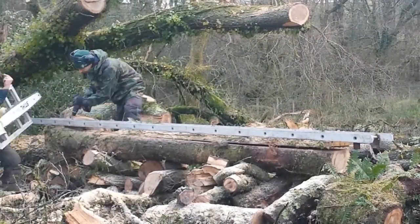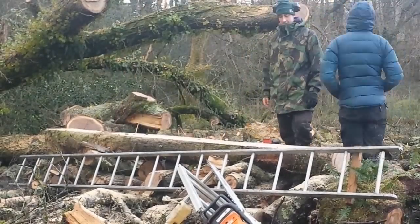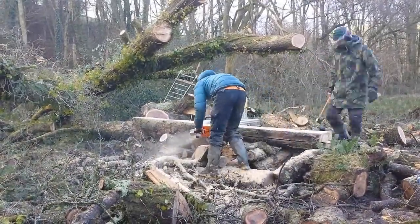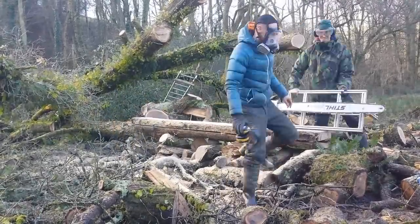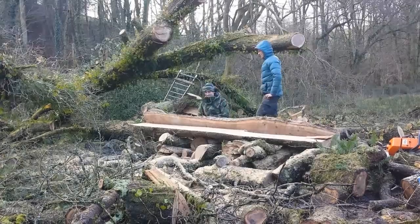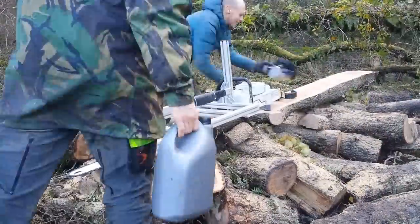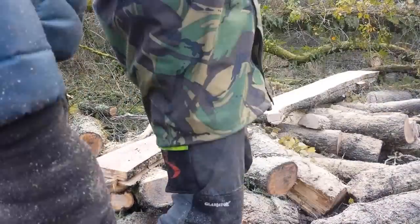It's not a huge branch but it's certainly a nice bit of wood to warm up on, and there's some really nice oak heartwood in that that Paul's probably going to use to make a workbench. Somehow I managed to not record the next slab, but hopefully my chainsaw milling is better than my videoing. Now that we've established a flat edge on this, we're leaving the ladder off — mainly because Paul's there to help. It's probably the first time I've done any milling with another person and it sure does help with the beginning and end of a cut. With that big slab cut, we had time for plenty of umming and ahhing and measuring before realising we could actually cut it in half. There wasn't a lot left to that log but after a little bit of refuelling it was still worth taking a 2-inch skim off it — there's still plenty of heartwood in it.